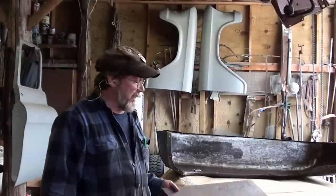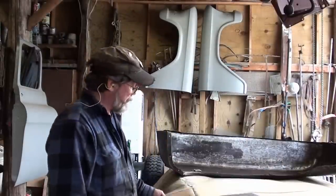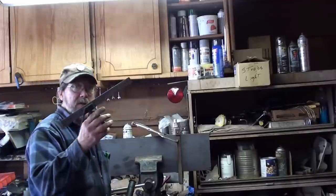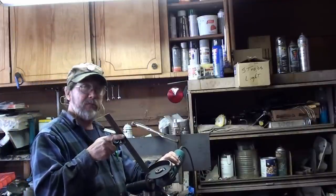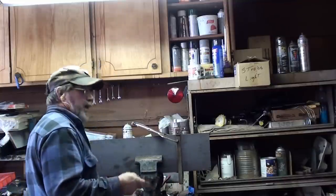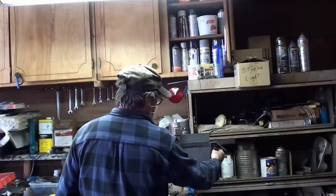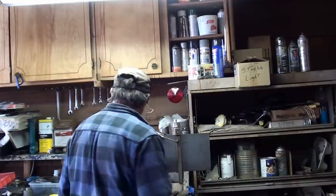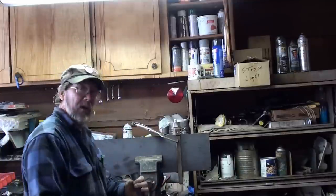So according to the plates on Whitey, I need a 5 5/8 square and one 7 1/2 by 5 5/8. Time to get working. I took my square and put it flat against there and found out it's 21/32nds from the guard to the blade. So I added that to my 5 5/8 and then added another 16th for the kerf of the blade. Clamp up my bar and away we go.